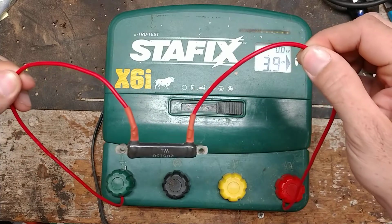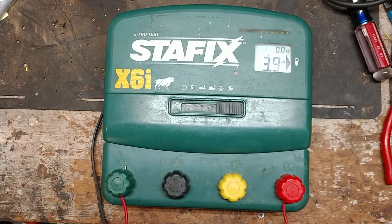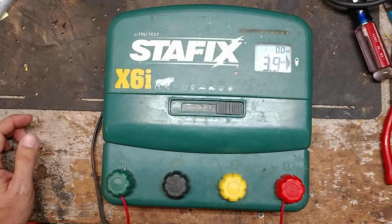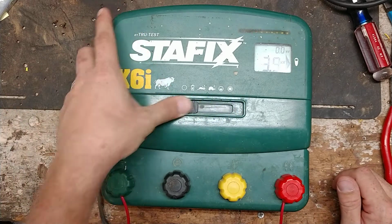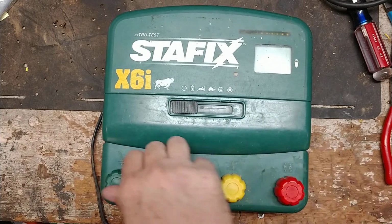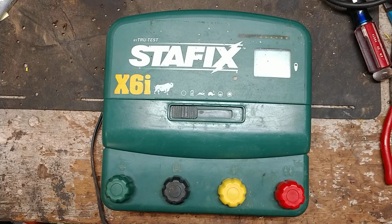This is a 150 ohm, 20 watt resistor, and this thing is blazing hot. You put your finger on there, it's hot really quick. So that's why it's rating so low, because I've got a pretty heavy load on it, stressing it out. See, there it went. It shuts off for about a second and turns back on. So I imagine that's what's going on. Well, let's tear into this thing and see what we got going on. Yeah, pretty darn hot.